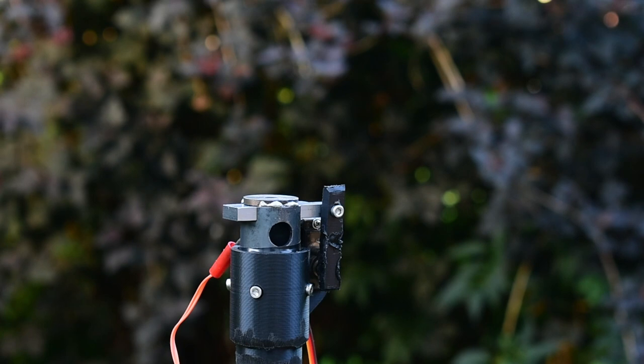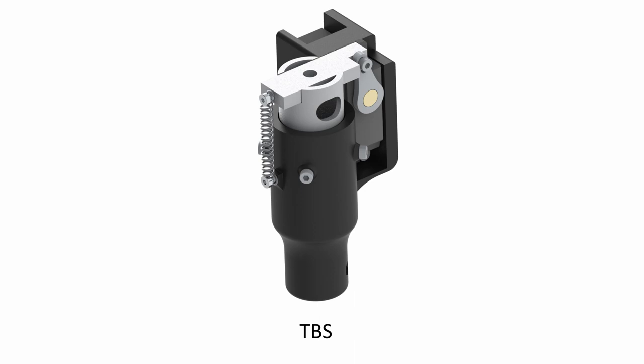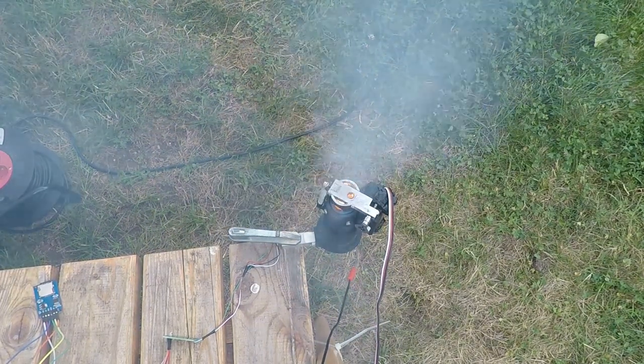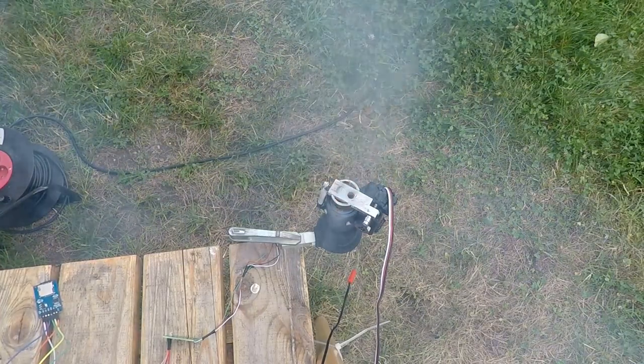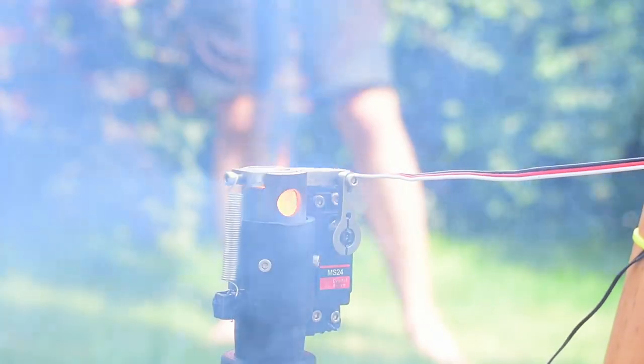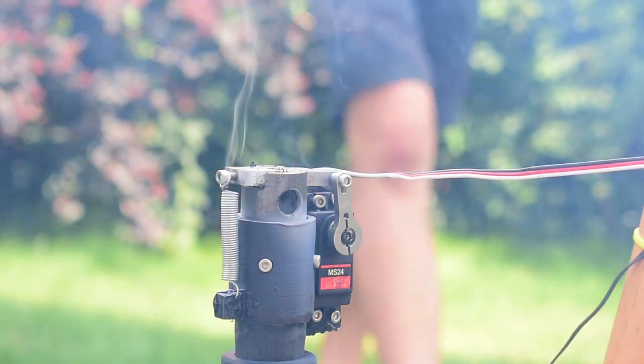This is achieved by a metal plate that slides in front of the exhaust of the engine. We tried different variations of this design but came to the conclusion that it would be best to create the holdback force via a spring. We then assembled this system and tested it on a load cell to measure if the thrust can be reduced — and it turns out, yes it can.